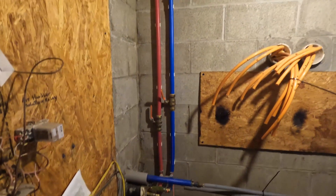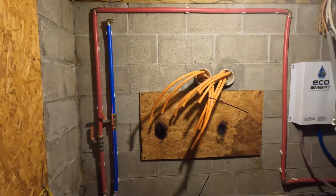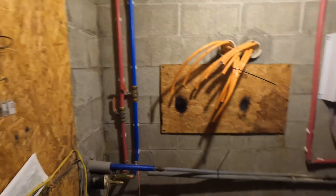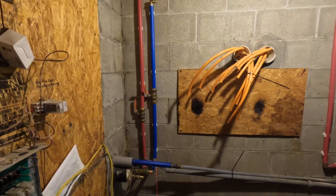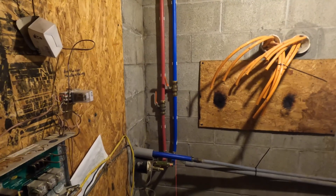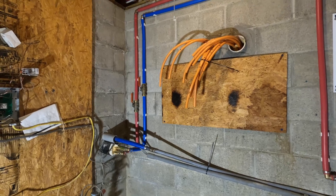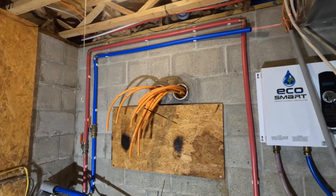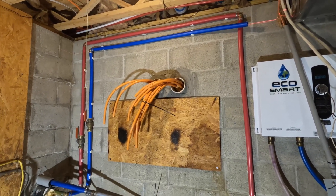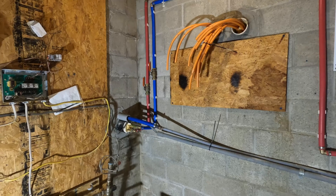I'm liking how it's looking — it's shaping up very nice. I'm trying to keep everything out of the way. I'll run another line across, secure it, and then wait for my manifolds because that's going to dictate where everything goes. I do have a circulating pump outside on the wood boiler, so that would be pushing hot water from the boiler. I have my valves here so if I ever need to change anything, that simply turns everything off. I got both my return lines run — the blue stands for the cold return. It's not really cold, but it's not going to be 180 or 160 degrees like the red. The red is considered hot, coming right from the boiler.